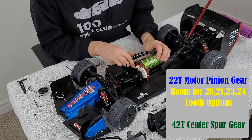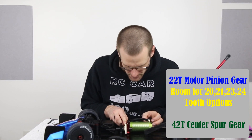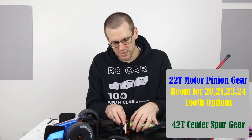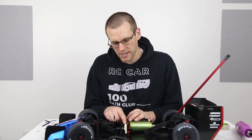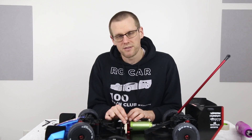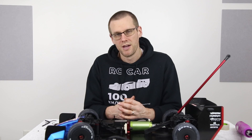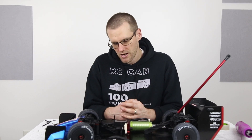I'm liking how it looks so far. That goes to show exactly what we're trying to accomplish — we got a little bit of room where we can make some adjustments. We're actually very close to the center of our range, which means we can move almost the equal distance out versus in. It does look like our gearing is going to work. These have been mocked up using 3D printing. What I have for mocking these up is professional CAD software that has a library for all kinds of gears — no matter which gear I'm looking for, I can go in and select almost like a configurator, hit go, and it creates it. I only need to add features like the bore or cutouts to the major part of the gear.